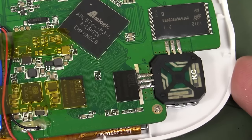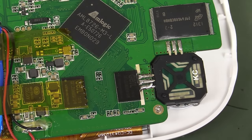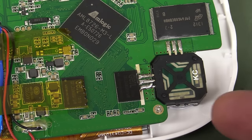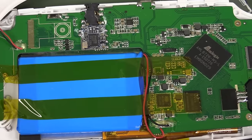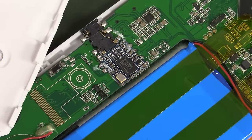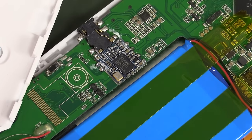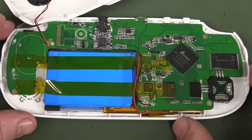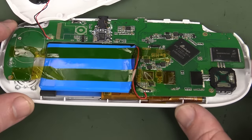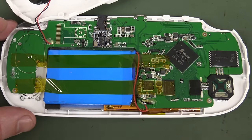We've got some memory and the little joystick down here - that looks funky but it's just a joystick cheaply soldered onto the side of the board. It's built down to a price, does the job. Basically one big system on chip - an ARM Cortex A9. And that for all the world looks like a Realtek Wi-Fi module. There's a headphone socket and USB for charging. Hard to find info on it - sort of discontinued, as you'd expect. These things have a six to nine month lifespan. Tens of dollars, maybe?